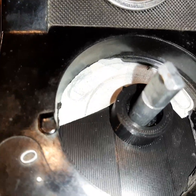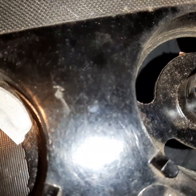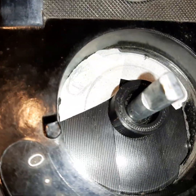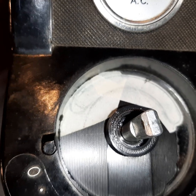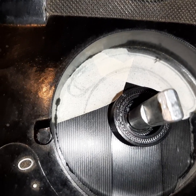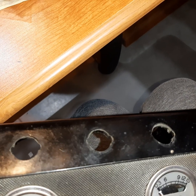Now what I'm doing is I'm sketching - really sketching with a pencil - the notches that go in to clear the knob as the knob fits in and rotates. I'm going to mark those in, and rather than trying to draw them geometrically initially, I think I'm going to make one by hand following the template and do a test fit. And then if I like it, I can enter that information and print a new one.